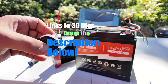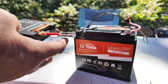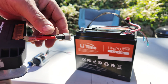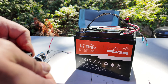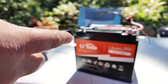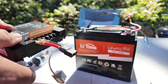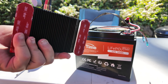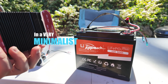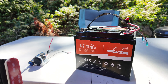Same with the 12 volt outlet — I've got everything pre-wired up, and I already have the outlet on here. For the solar input I'm using an XT60 connector. We can pop this dust cap off, and this gives me a great way to have the leads be detachable from the battery for the solar panel. Let's get to mounting this stuff together and see if we can create a really great little solar battery source for your kayak or whatever purpose you have for a handy 12 volt cell.